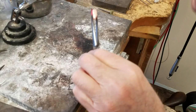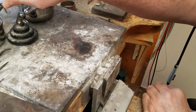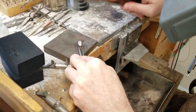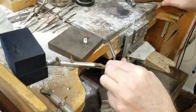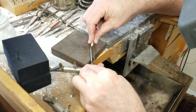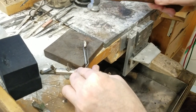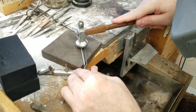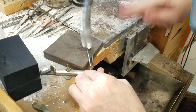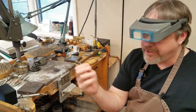We're going to let that cool until the glow goes away, then quench it, and then hammer it. Rotate the piece — be aware of how hot it can be. This is actually a little bit easier to do on a bigger piece because the locking tweezers will grab it at the four corners. So that's how you do that — we don't even have any flashing in here, and this is a good start.